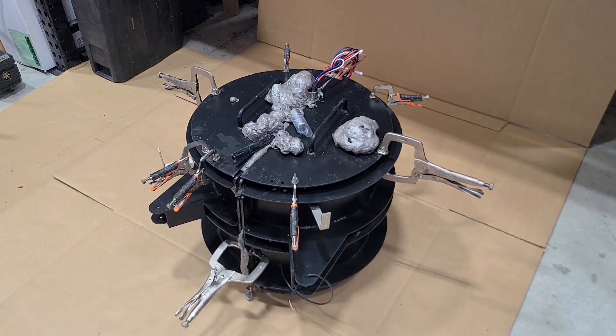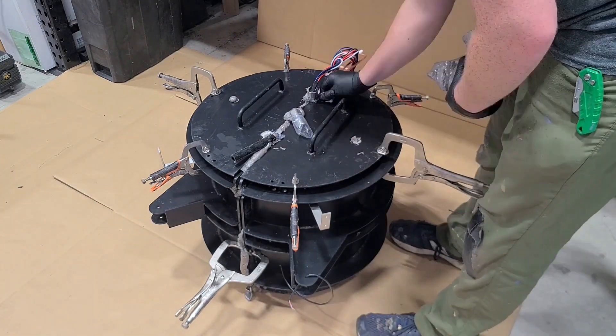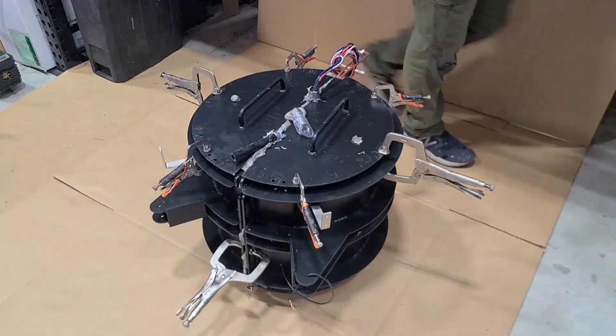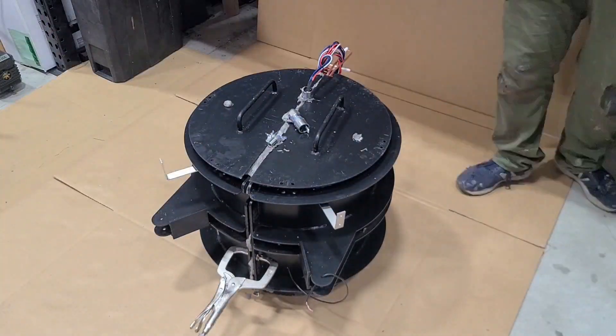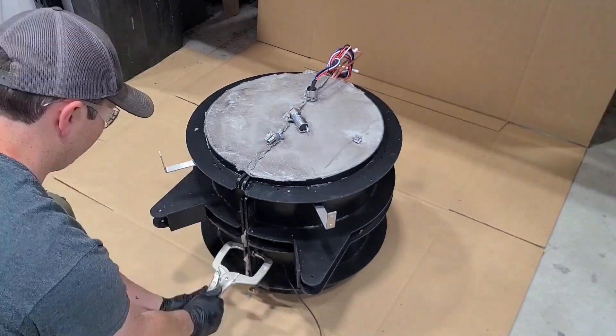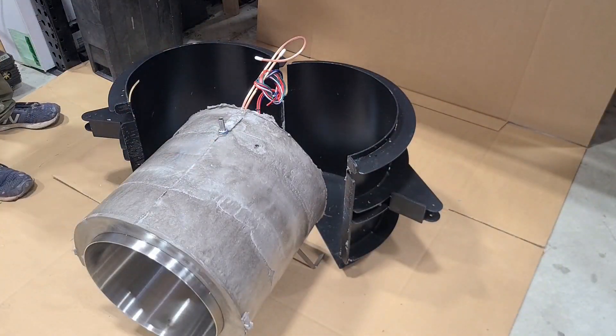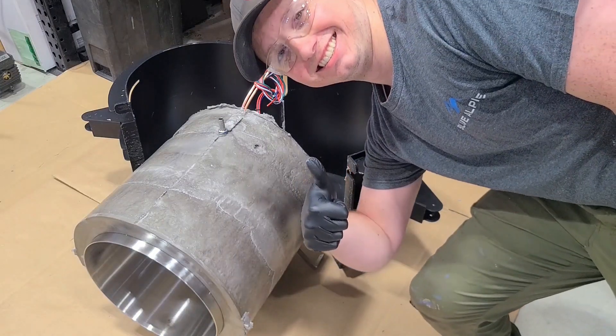There's another company out there that's actually wrapping their copper in essentially a foam sheet, and that can cause huge problems because if there's not an airtight seal you will have ice forming on these copper lines. The foam itself also helps to keep everything on the pot like sensors and the copper itself, and because we pour it in place it actually forms an airtight seal around the copper.